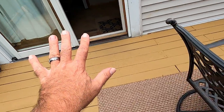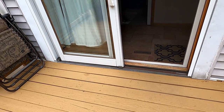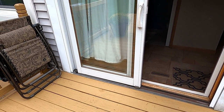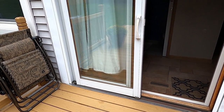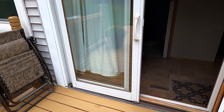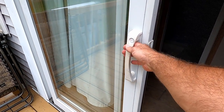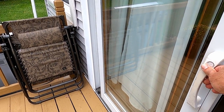On my first attempt, I took the door off and when I realized I wasn't going to put the new rollers on right away — there was going to be a little bit of time before my new rollers came in the mail — I went ahead and WD-40'd and then white lithium greased the rollers, and believe it or not I got a tremendous amount of smooth movement back.